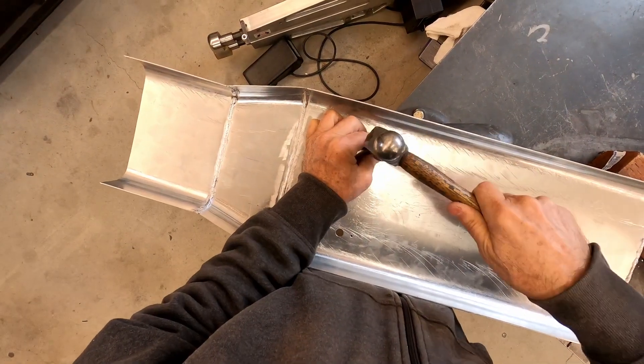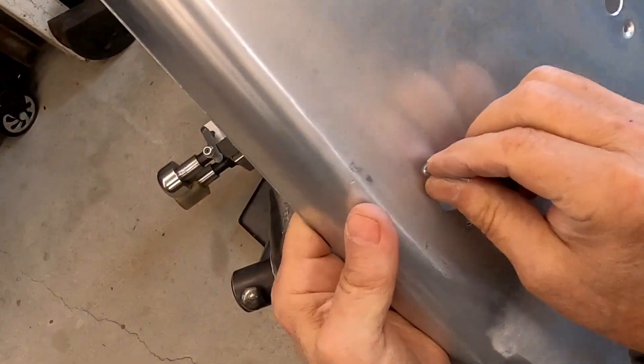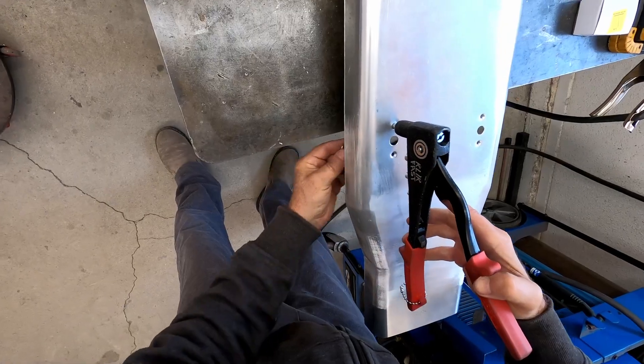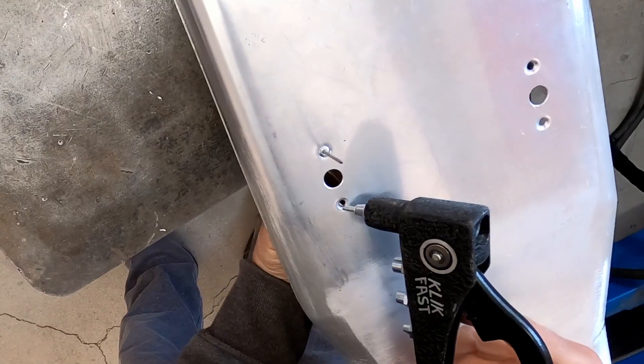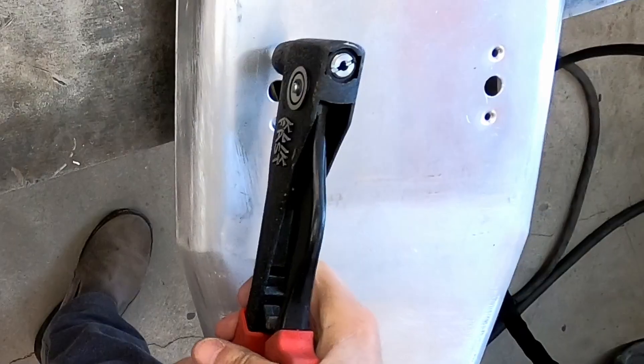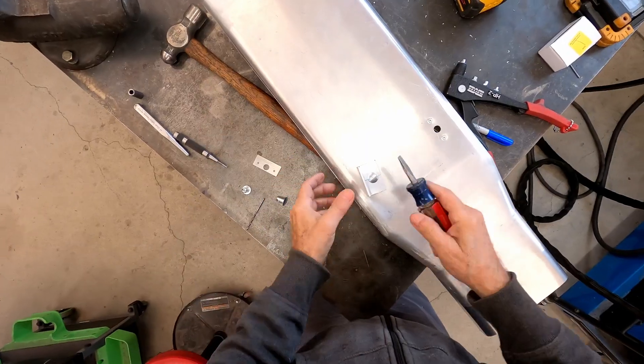What I'm doing here is making room for the rivet head. The way I do it is to secure a large center punch in a vise and then place the work over the punch. I use a small piece of steel tubing for the female side of the punch. I want it short enough so I can look inside to center it in the hole. The nice thing about this operation is that it's easier to handle by myself.